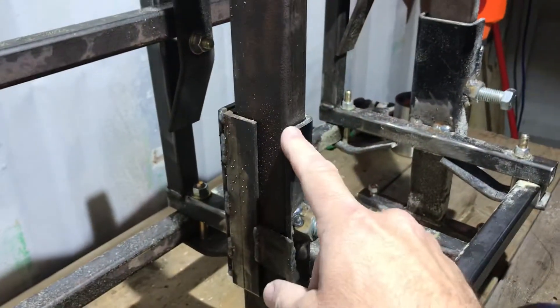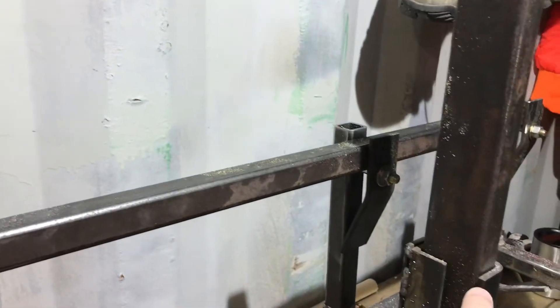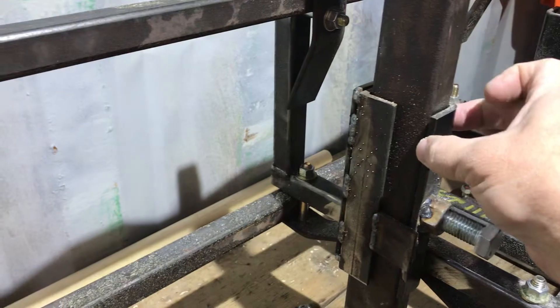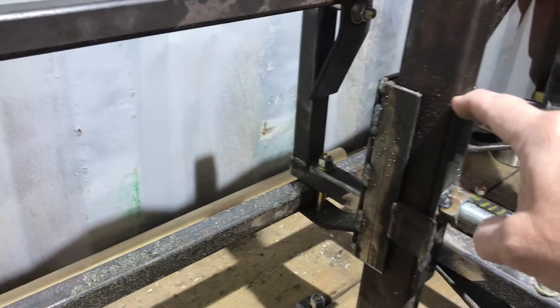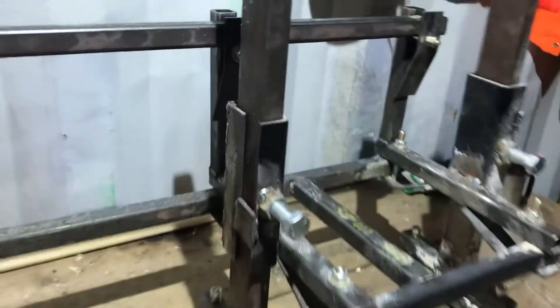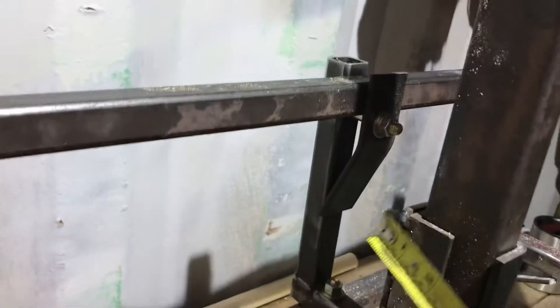This is a six-and-a-half-inch piece — I used it because I just found it and it was easy. It needs to be a thick wall. If you can get another rectangular piece that fits perfectly over top, or find a dimension that works, you may have to change the thickness on this one. It needs to be a quarter-inch thick wall; if it's one-eighth wall it flexes, and you don't want that flex. A one-and-a-half quarter-inch diameter dimension would give you the proper size, but it's not readily available depending where you are. I used an angle iron to shim up that space and it worked fine.